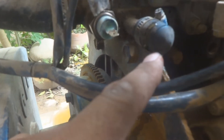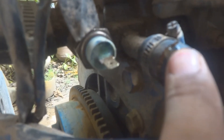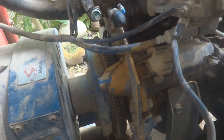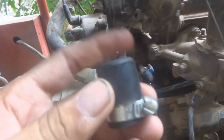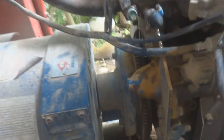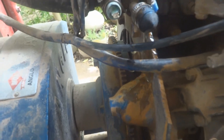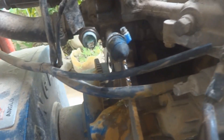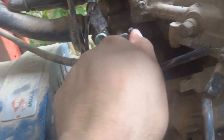This dead plug actually went defective. As you can see, it is cracked from here and it is leaking. So we are going to replace this dead plug — this rubber dead plug — with a new one. I just brought this new one; this is good quality. The existing one is very bad quality. The people making such generator sets are just focused on getting it running and are not taking any care about the client — that it will run reliably for them.